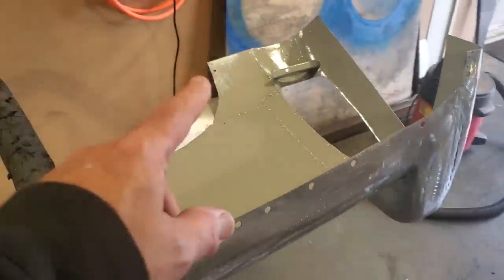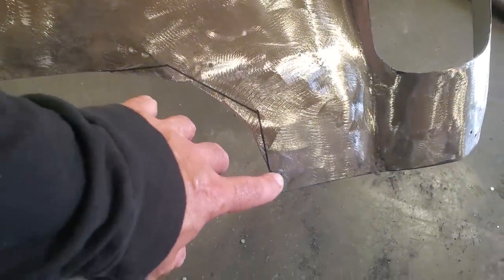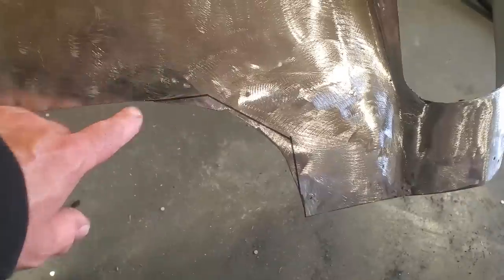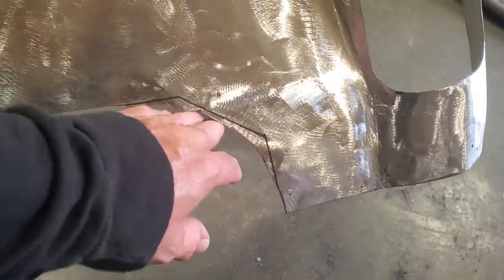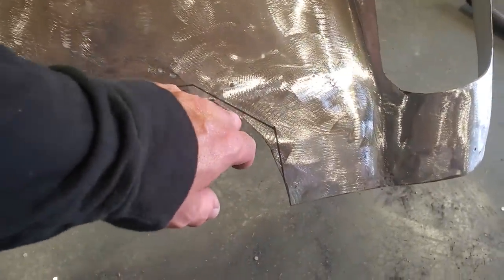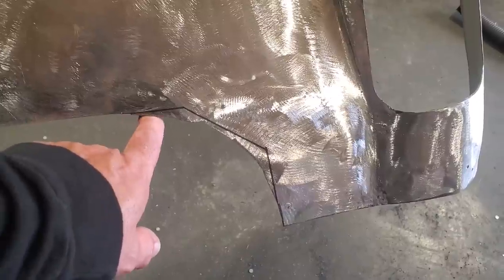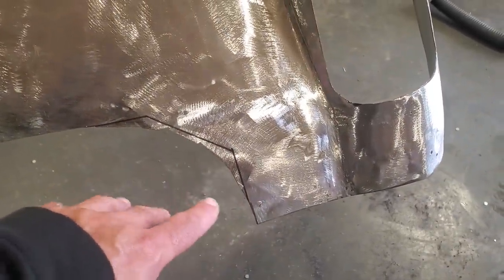Now the next thing I got to figure out is up here on this top side. When I got done here, I know where my clecos got to go, here and here. And I got it marked off for a straight edge. I do this because it's a lot easier to do with the grinder. You can sit down and try to cut this out of the car and do a butt on this here, but it's a bit tricky. You can use a saw or something to cut it around the corner, stuff like that. I just find it takes up too much time.